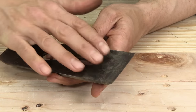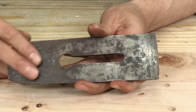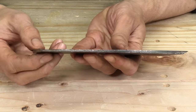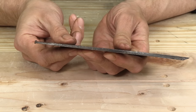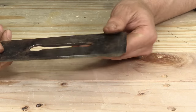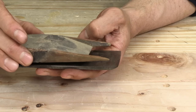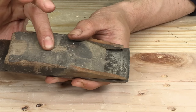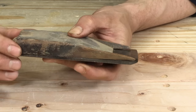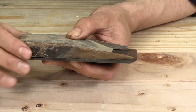Now, they're also forged — that's how you get that laminated construction. But it also means these have a very rough texture compared to those Stanleys. Up here this is all rust, but we don't have to worry about that because we're just going to hit it with a hammer anyway. This is really mushroomed over here — it's bent over a lot. That's because this is a softer steel; a hardened high-carbon steel wouldn't do this. The last thing is these are tapered, which means they're actually a lot thicker at the business end and much thinner over here. That taper is the opposite of the wedge, and when they're tapered in opposite directions like this, they hold very tightly. Planes with tapered irons and wedges adjust very easily for a deeper or shallower cut.